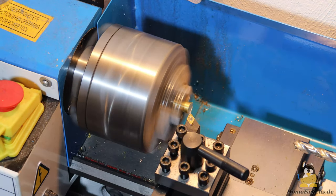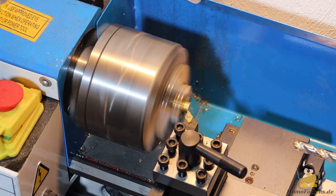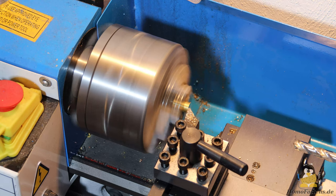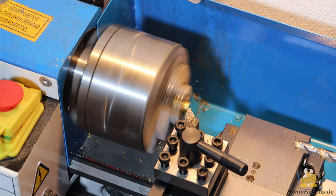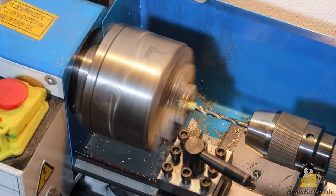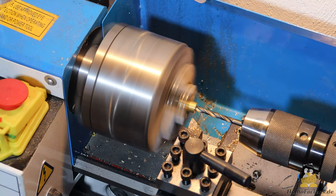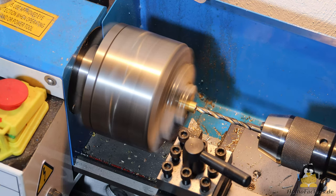The upper and lower parts were made from 10mm round brass on my lathe. This is a cheap entry-level model that can at least machine brass with sufficient precision. And yes, even with my clumsy handling of this lathe in this video, you get a well functioning extruder. The lower part is 12 to 13mm long and is drilled through with a 5mm hole after it has been correctly cut to length.